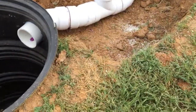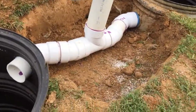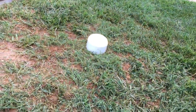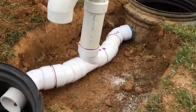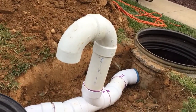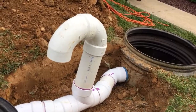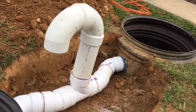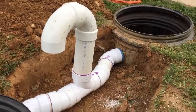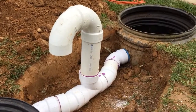There's the top of my filter and there's my float — when it comes up, like a sump pump float, it activates the circuit and an alarm inside the house goes off. We're going to paint it green so it blends in a little bit. The cap is perforated so it'll flow air and keep varmints out. Everything's primed and glued except for the 90-degree elbow on top, which stays loose just in case I need to lower it, raise it, or turn it for servicing. There you go — any questions, post in the comments and I'll do my best to answer.